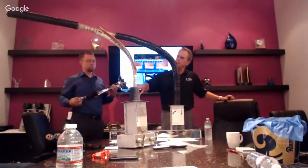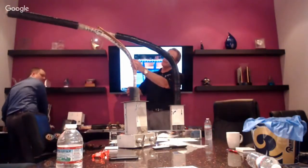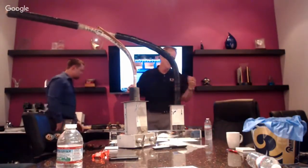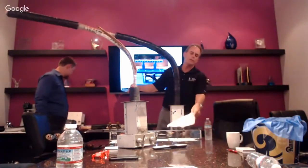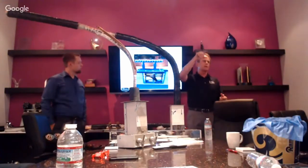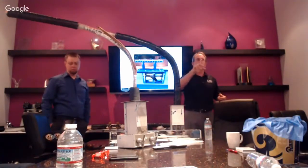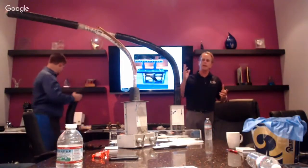So these are the leader lines coming up here, and then you can see these clamps, and then this is part of the restriction kit that we have to put in, and that's what this is. So when we start in the walk-in and we jack up the pressure up to 45 psi to move it down the street, into the bar, up into the tower, it's got so much pressure, it's going to come out way too fast, it's going to foam.